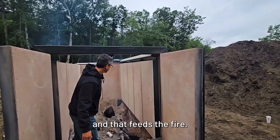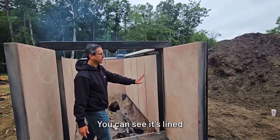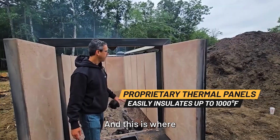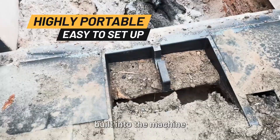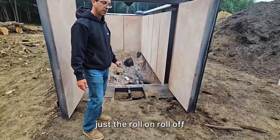The curtain creates a vortex and it feeds the fire. This thing gets really hot. You can see it's lined by ceramic panels that keep the heat in — this is where the burning happens. On this model we have a hook lift system built into the machine so it can be moved around easily on a roll-on roll-off truck.